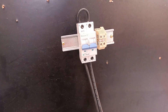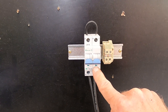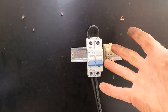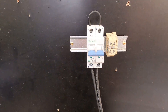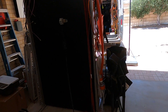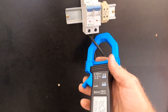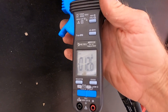I'm going to show you what used to happen with these and why you should not turn them off under load. This one was removed from a system with two inverters — one had actually caught fire, not through being turned off, but it was probably a little underrated, had degraded, and eventually just shorted out internally and caught fire. So I'm going to turn this on — I've grabbed my clamp meter and turned this circuit breaker on. I've created a dead short, and we've got 12.6 amps, which is a pretty decent amount.